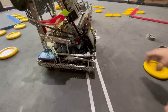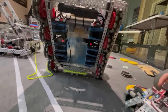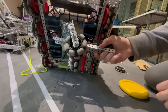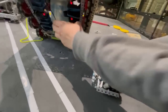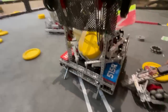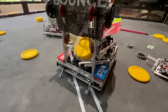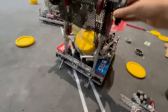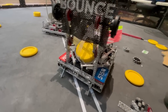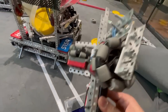We've been showing the robot completely without tracking wheels. We actually run zero tracking for match play, but for skills autonomous we bring these on and screw-joint them onto the robot to get the full force of odometry — there's a slot right there to put them in between. This was really nice because Logan could do cool stuff during programming, but during matches we could go over the barriers without getting stuck. Since this assembly weighs a pound, the robot's a little bit lighter with a bit better acceleration for matches. Relative PID movements were fine for matches, but when you have a full skills minute, we don't mess around.